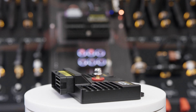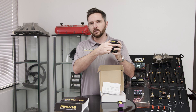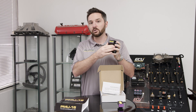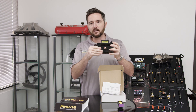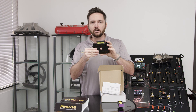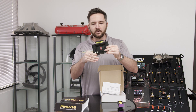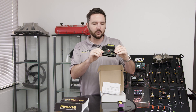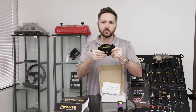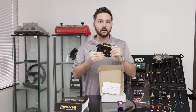Back it up to a metal panel if you can, especially if you're going to use it in a higher temperature environment. There are three temperature sensors on the board itself — you can monitor temperatures, make sure you're not overloading it, and balance outputs side to side. It has three nice mounting points that fit an M6 bolt, plus an M6 stud for the power input from the battery. Very small and compact, rated to 150 amps continuous, which is really a lot for this form factor.